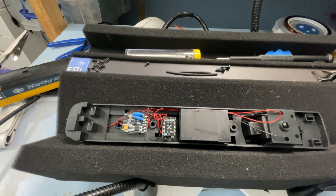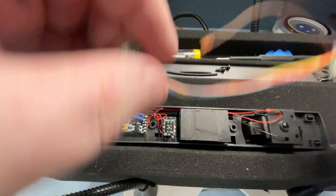As you can see on the inside of the engine it's pretty sparse - it's a Hornby engine but one of the older ones. There's your circuit board, and obviously there's where the chip goes - which is this Loksound V5 chip with the 8-pin connector on it. For this older version of the Intercity, on the inside you get all this plastic which you don't need. There were two plastic lugs which I've cut out to make more room.